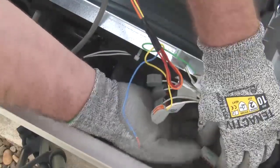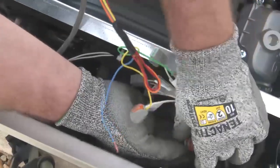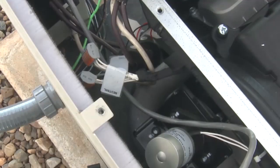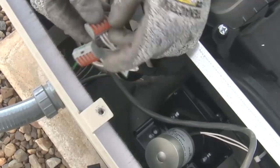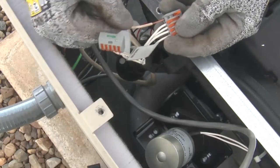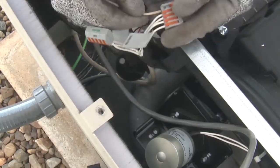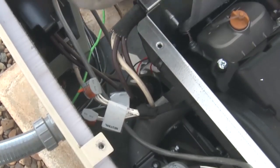More information about the ATS control wires can be found in the ATS Owner Manual. The 120 volt accessory power supply is also connected into the generator set wiring harness. This must be a 20 amp protected circuit taken from the utility supply. It is used to power accessories such as the alternator heater, battery charger, battery heater, and engine oil heater.